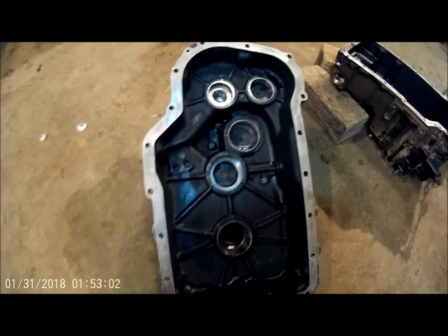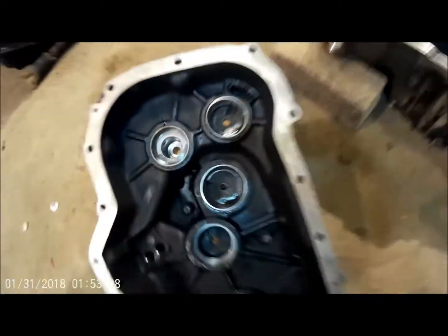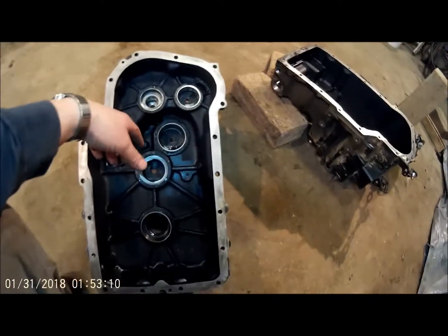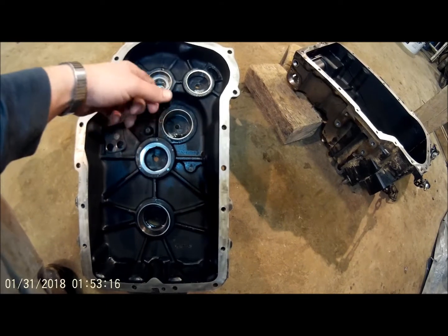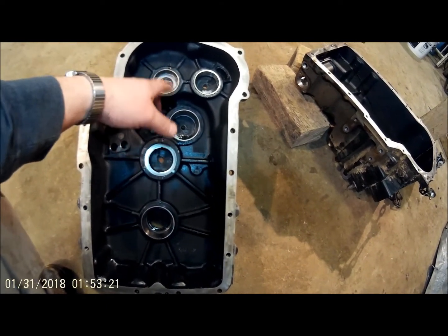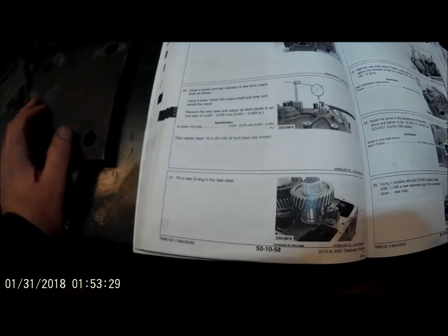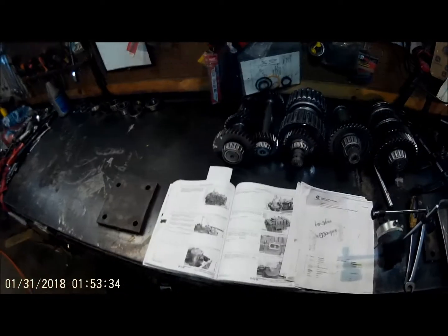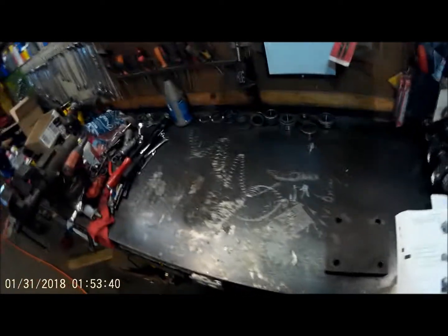They give you a pretty good breakdown. You can see these holes behind each bearing race — some of those have plugs. When the top case half goes on, that's where we are going to use the dial indicator to measure the end play in and out, and that will tell us if we are tight enough or not. Our specification is one to three thousandths of an inch of end play — basically as tight as you can get it without burning the bearing up.